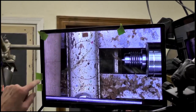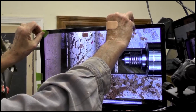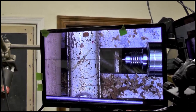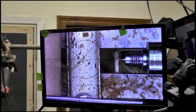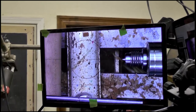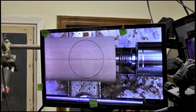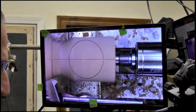What I'm going to do is align this template to it. I got a point there and a point there, and I'm aligning — so that image is over the top of my TV, and I'm aligning that center line to my drive center and my tail stock. That way I know I'm not cutting an oblong elliptical shape — I'm going to cut a sphere. Then I put the block of wood back in, and I have a pattern to cut to. I'm just using a roughing gouge right now — I could cut the bulk out of here.